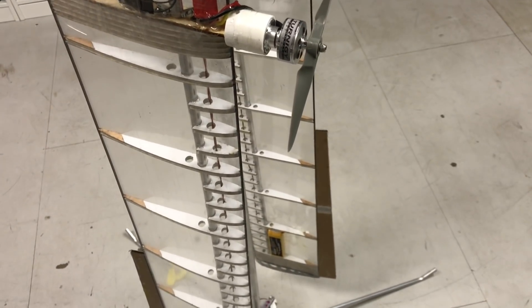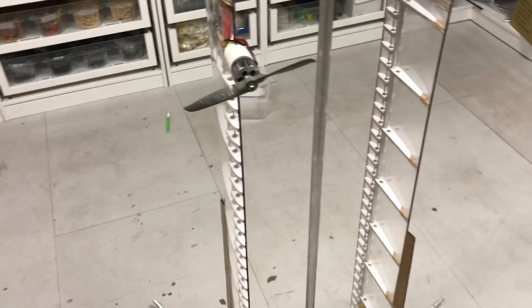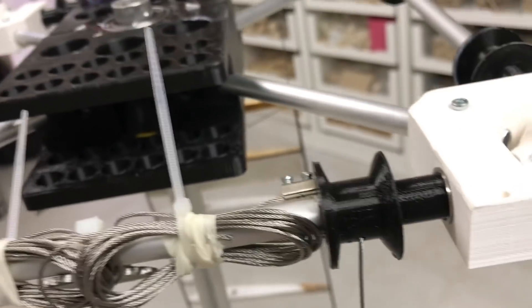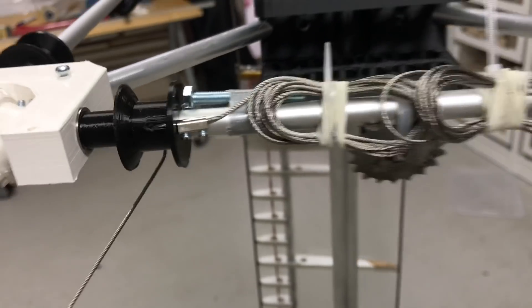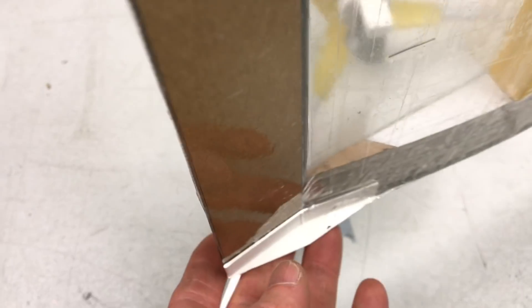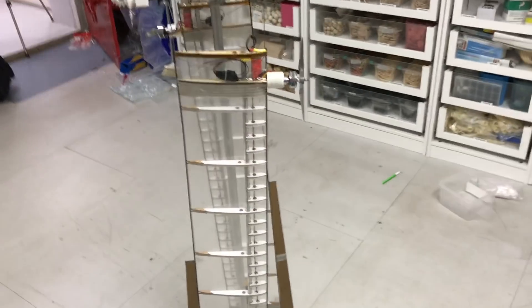It's just standard hobby parts, and the wings are made using foam board and packing tape, which produces a very pretty result. It is the same airfoil as in the previous clips but scaled down and more accurately put together — the wing halves are within one gram of each other in weight. The structure currently lacks the pitch angle at the root where the wires come in, but I have a fix for that, as I think it is important to mount the wires to help the wing keep its upward pitch. It is supposed to have four blades but currently has two or three, and the control surface is set at four or five degrees up pitch.